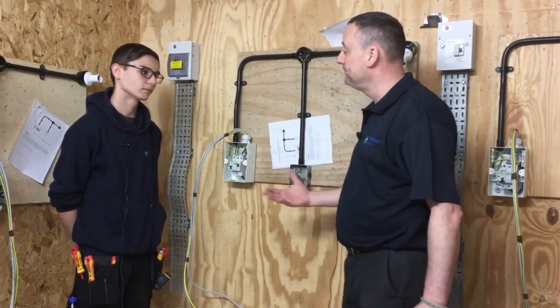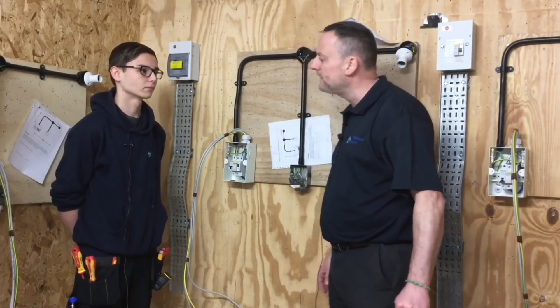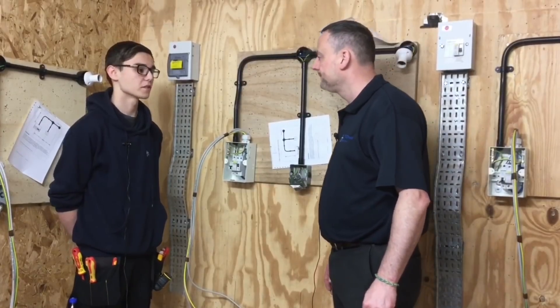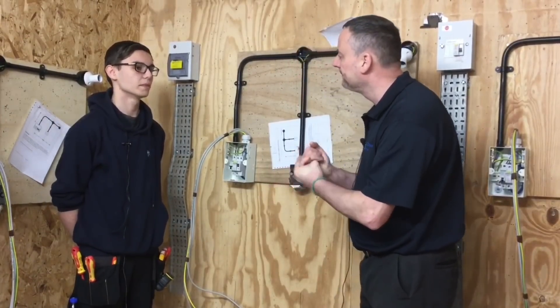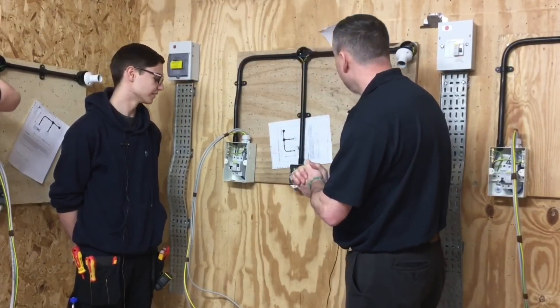We talked about the need — or the lack of need — for an RCD on this circuit. However, our distribution boards have an RCCB. If the RCD was there for additional protection, what's its maximum milliamp rating? 30 milliamps. And what type of faults will an RCD clear? We've installed a lighting circuit — size of the breaker? It's a B6. Okay, B6, we'll go with that.